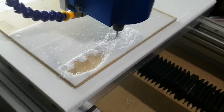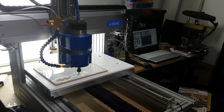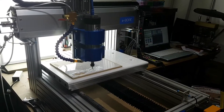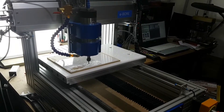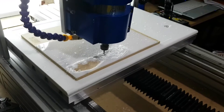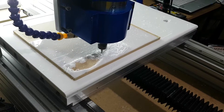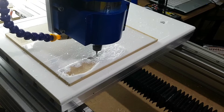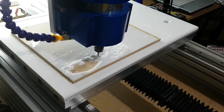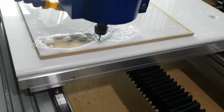Good, eh? Anyway, I'll turn this off for the day — driving everybody absolutely bonkers in the house. I've decided to make the shoe for the dust extractor out of Delrin, because this is a plastic that — it's called acetal — and it actually doesn't melt when you get a high-speed bit on it. All the other plastics don't like doing this because they just melt, and then the tip gets bunged up and it doesn't cut. But this is now cutting its final bit.